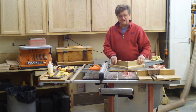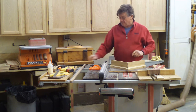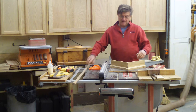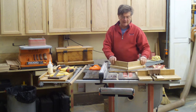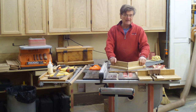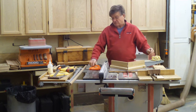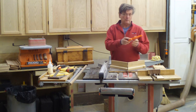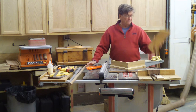In front of the saw, the first accessory you want to get is an adjustable roller stand. You never want to be taking a long piece of wood that's hanging out over there and trying to keep it from falling while reaching over the blade. Never reach over the blade — I've been hurt twice in six years and each time it's because I reached over the blade. You can buy many safety features with your saw. This is a manufactured feather board — it fits in the groove, keeps the wood tight against the blade, and keeps it from kicking back. You can also build one.